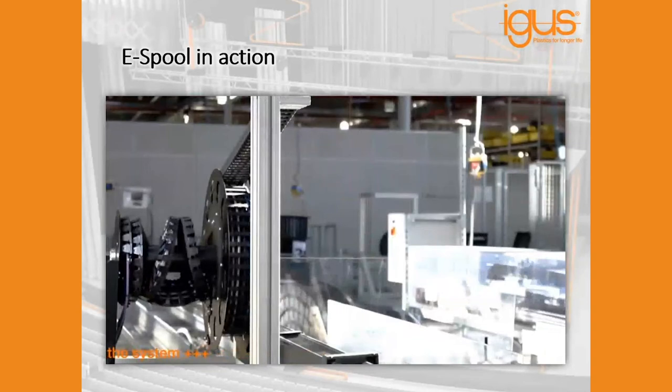So that goes to show how exactly the twister band moves. It essentially allows for a complete home run of cable. So from whatever the source is to the rotating member is one run of cable. There's no intermediate breaks, no brushes, nothing to introduce electrical noise or points of failure. Just a single run of cable that's run through the e-spool all the way to the end of the line.